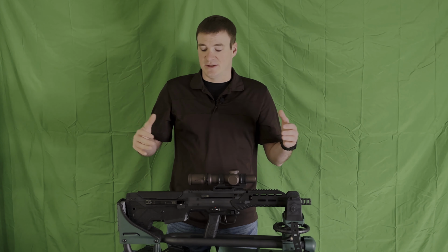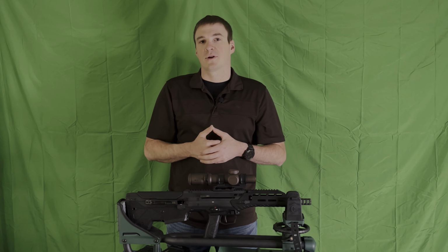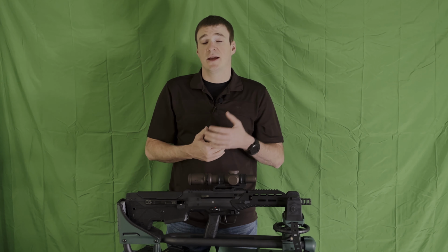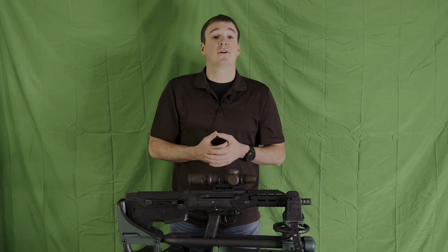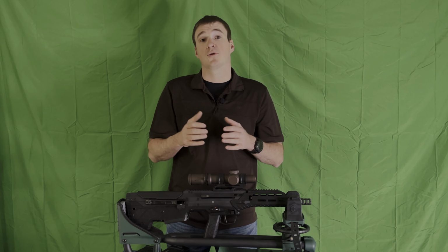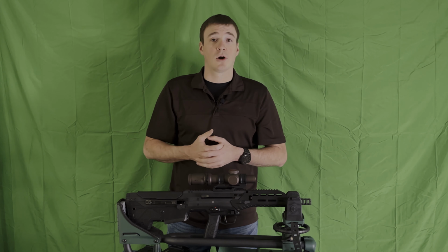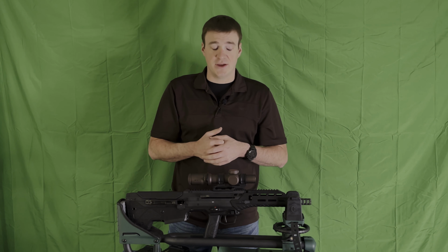Adverse is if the gun's starting to really get dirty, it provides a little bit more gassing. Obviously suppressed cuts it down for use with a suppressor, and normal is normal, and they allow you to fine tune that. So if you need just a little bit less or just a little bit more for your particular ammunition, you are able to change that. Another very cool and well thought out feature.